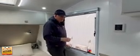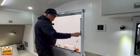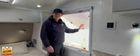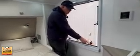These windows have got 3-stage click-out struts on them. To release them, press the little grey button in the middle of the lever and swing the levers around. And then you've got 1, 2 and 3. Okay. As you can see, you can open that window very wide. To release it, just lift it up a bit and drop it down. And you could do that on each stage. The trick is not to go up to the next one. There we go.